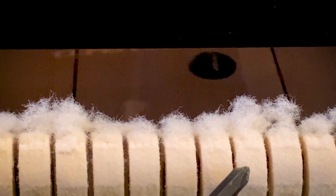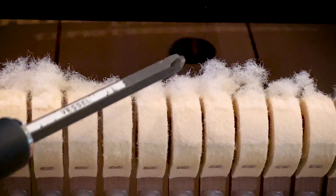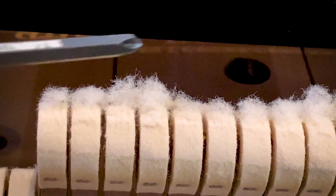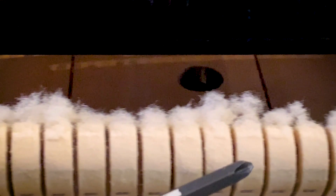You can see here there's a ledge — that is the difference between the layer I filed down to and the layer above it that's still there. We're peeling upward. As we file we're peeling the layers like an onion. You don't want to just go ripping through those because the string grooves are below that layer and the top of the hammer will become a terrible mess. So we're going to do each side like this, bringing it close to the top to create a little island that hopefully hits just above the bottom of the string grooves. We want to preserve the string spacing and string leveling, but get just so there's a touch of string groove left — three or four millimeters on the top of the hammer.